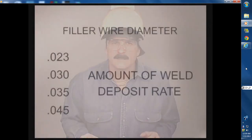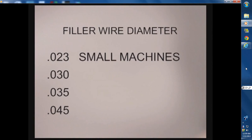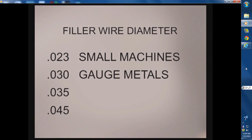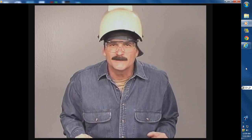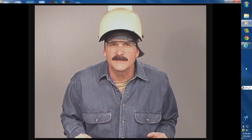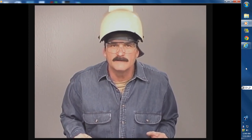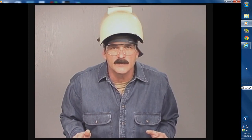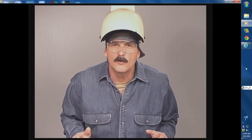The diameter of the filler wire is selected for the amount of finished weld required and the deposit rate. .023 is often used with smaller welding machines; .030 is generally used on gauge metals; .035 is considered most efficient for metals up to three-sixteenths of an inch; and .045 provides high filler metal deposit rates on heavier metals. For general purpose welding with varying metal thicknesses, using a smaller wire like .035 and turning the machine up for thicker metals generally gives better results than using .045 and trying to run cold for thinner gauge metals.